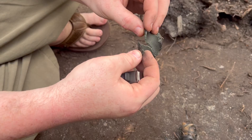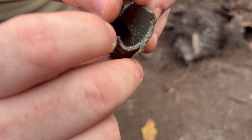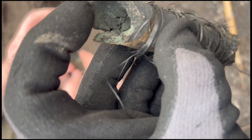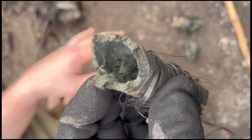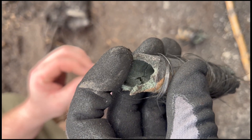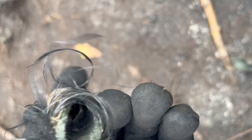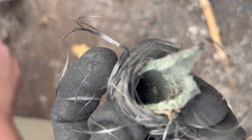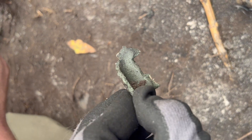You can see plainly on the end how it goes from black and dark gray to still having the nice green color of raw propellant. There's some cracking in the center — that is definitely from when it came apart during the explosion, not from burning. You can see the cracking right there with no carbon present in the crack, and you can even close it up cleanly — so that grain definitely exploded and tore rather than burned through.